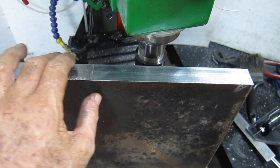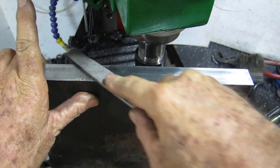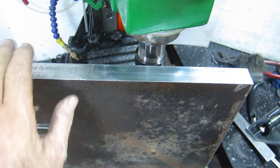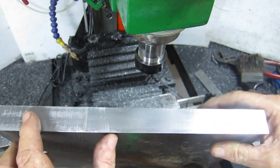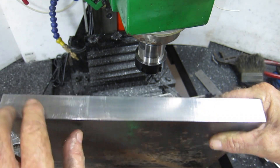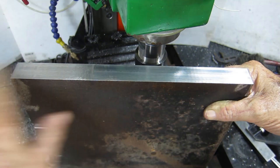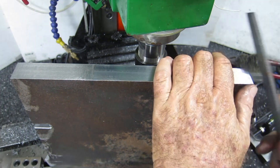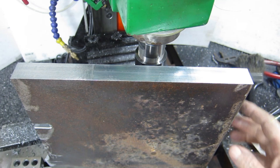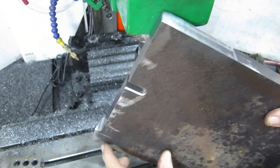They quite didn't overlap and there's like a little ridge there - probably 0.1 to 0.2mm. But it doesn't matter, I'll get rid of that. There's a bit of a difference between the finish from side milling with that four-fluted end mill in the X axis versus the Y axis - Y axis is always crap on this thing. But I'll sort that little bit out. These sides are not important at all. Next cab off the rank will be cutting that 25mm off the bottom so I don't end up with a step.